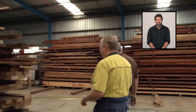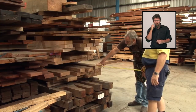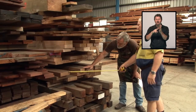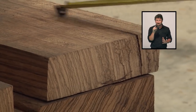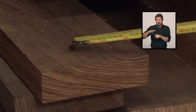This is the 50mm Zebrano — I know it's thicker than what you want, but I wanted to show you this first. The Zebrano is quarter sawn, with the grain pattern running straight up and down, so it's considerably more stable. This other piece is back sawn — in veneer they call it crown cut. The grain runs side to side in back sawn and face to face in quarter sawn. Quarter sawn gives you a straight line in most species, while crown cut or back sawn gives you a wavy, cathedral-type grain.